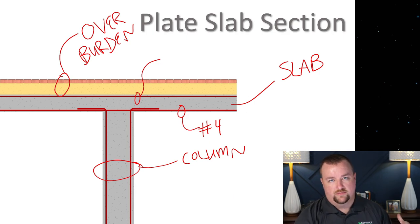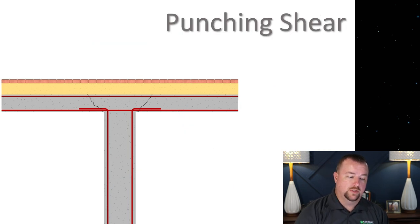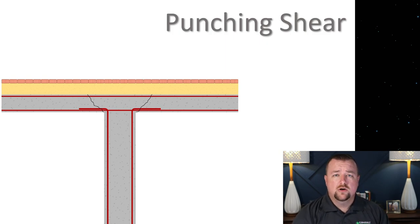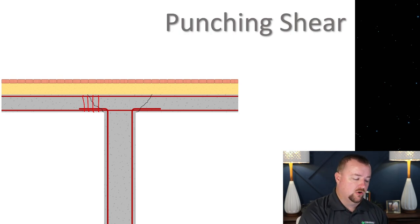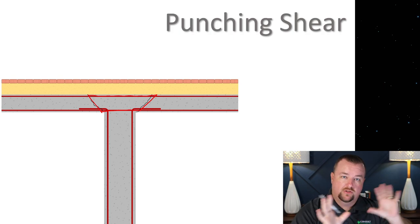We've looked at that in previous videos. A structural engineer emailed me saying he didn't see where they used shear reinforcement. Back in the late 70s, they were working under ACI building code 77, and a lot of buildings were not designed with shear reinforcement. Looking at punching shear and how we would expect this column to punch through, we can see shear cracks that go right through the slab. In modern flat slab construction, we would add rebar, stirrups, or prefabricated shear reinforcement — steel across that crack interface — making it much harder for the slab to fail.